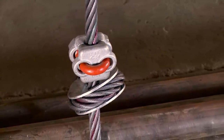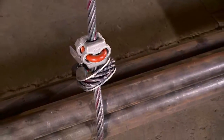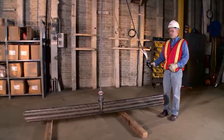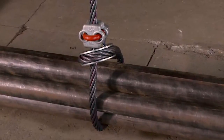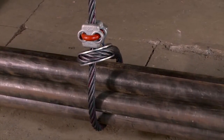By applying the proper torque it'll seat itself properly, it won't damage the wire rope, and it can be used safely. I'm going to raise the load slightly and then set it back down to show how the clip works. The design of the clip eliminates stress points or damage to the wire rope, and as we set the load back down you can see that the choke remains in place and prevents the load from spilling out into the work area.